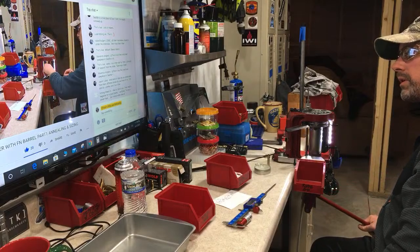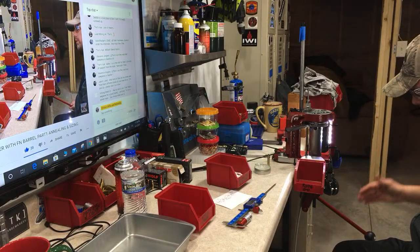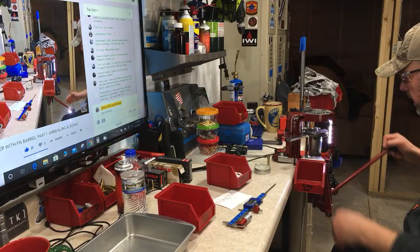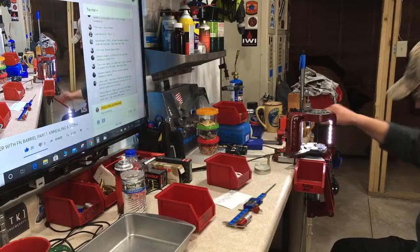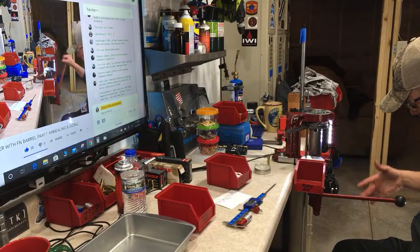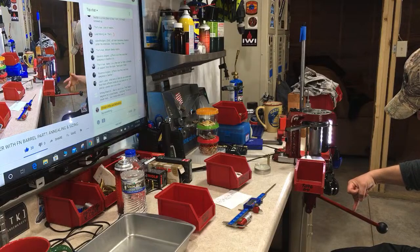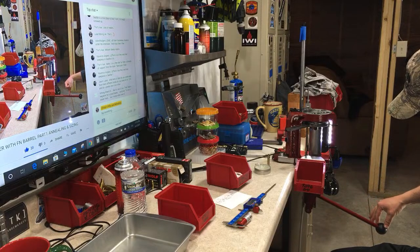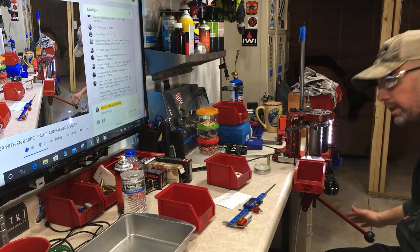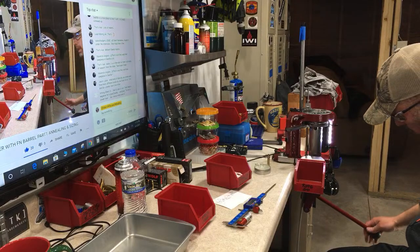So I'm gonna, and you can see I'm slowly moving, consistent running of your handle and consistent running of your ram equals consistent headspace bumps. You notice I don't slam this down, and you notice at the very end, watch this. I'm doing this with my pinky, and it's hitting the overcam right there. And then I'm overcamming. Stop. I don't press down on the handle. The second it hits the bottom of the overcam, and I don't let it slap home.